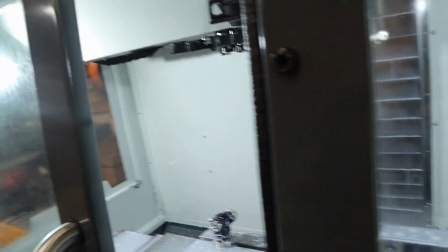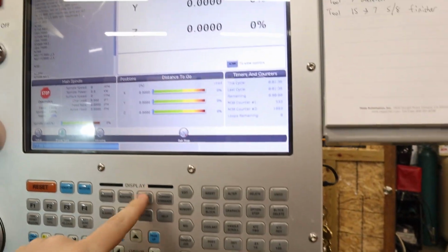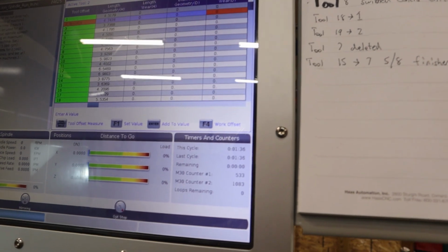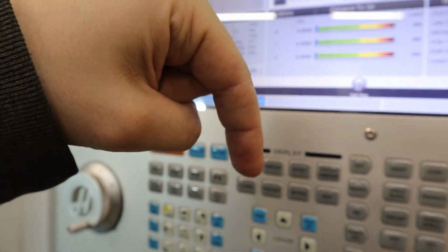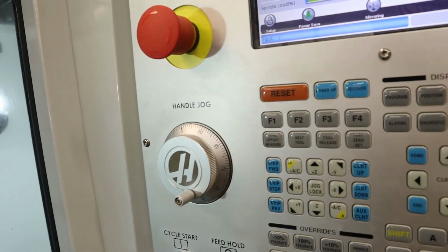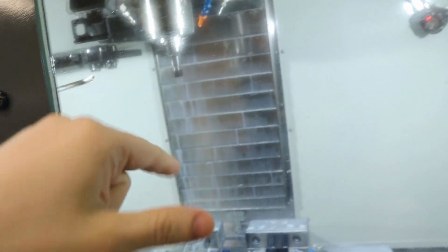I set up a contour toolpath, and what we're going to do is send the toolpath down in there and then cut a circle using our wear offset, and that's going to be diameter wear here. To start, we're going to do -2 thou, which is going to actually take the contoured circle, the toolpath, and push it out 2 thou. So you're comping for the actual tool diameter, and we'll just comp that out until the gauge pins fit, and then we'll check if our dowel pin fits.